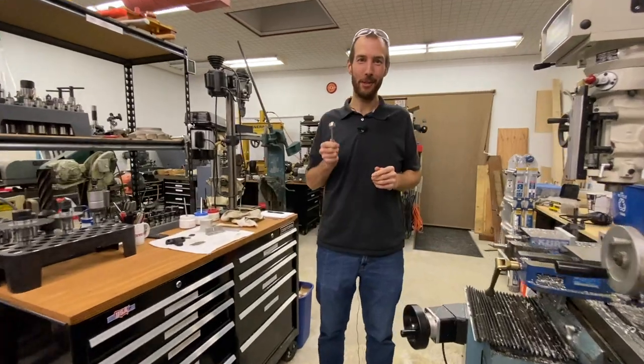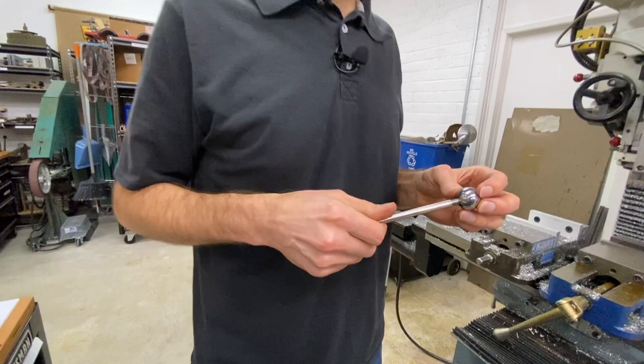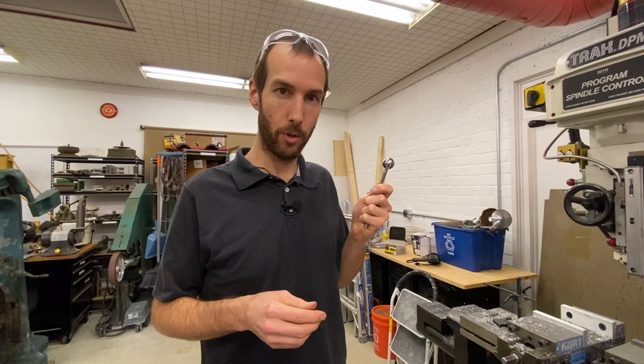I have a quick old trick I want to show you today. What I'm going to call this is a vice ball. I don't know if there's a definitive term for it, but it's a very handy tool for doing very precise square milling or clamping of parts that are odd shaped — maybe castings — something where you just can't get a good reference surface or a good clamping surface on the part.